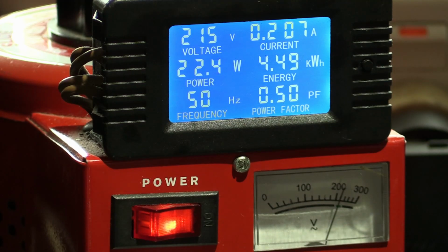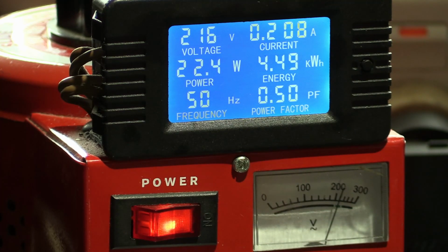Let's just have a look at our voltages on the 6V6 socket. The 6V6 is currently not installed. So pin 3 is our plate, and it's got 422 volts on it. Pin 4 is our screen, 421.